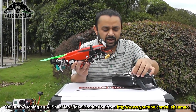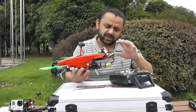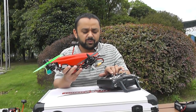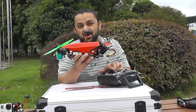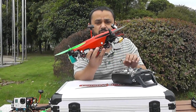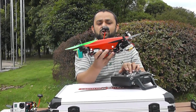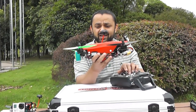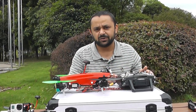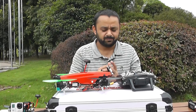What we need to do is add another mixing using another channel to cancel that tilting effect, by mixing elevator to elevator with negative values. I will explain how to do this mixing later in the series of videos, but right now I'm just describing the concept. When you cancel that effect, pushing the stick forward — say 50% — your quadcopter picks up speed due to rotor tilting, but the flight controller powering up the rear motor and powering down the front motor is cancelled. So your quadcopter will tilt only a little while the motors tilt more, and you get a lot of speed. This is how the tilt rotor works. The build and setup videos will show how you set it up — so that's enough. Let's fly it now.